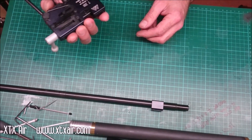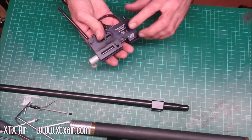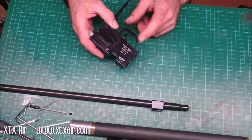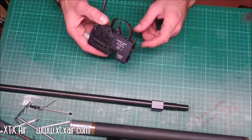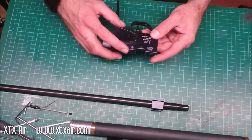While I'm here I'll go over a couple of things that are quite common with the S200. Make sure the hammer area is free of dirt. The other thing is the triggers are often not so good out of the box, but there are tuning guides on the Air Arms Owners Forum and a number of other forums that make the trigger quite good, so it's worth having a play with that when you've got a minute.